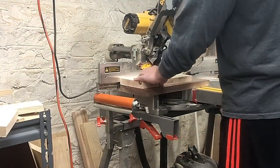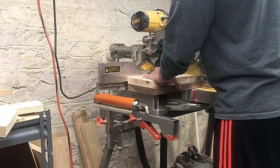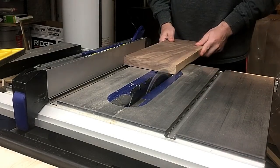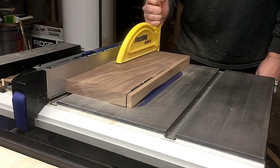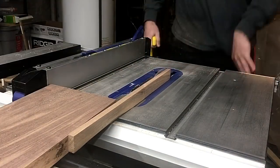I started out by cutting down some maple and walnut to about 12 inches long, which is around 1/4 the size of a normal beanbag toss board. Next, I went over to the table saw and ripped them down to 2-inch strips. Each board will have 3 strips, making it 6 inches wide. A regulation cornhole board is 24 inches by 48 inches.